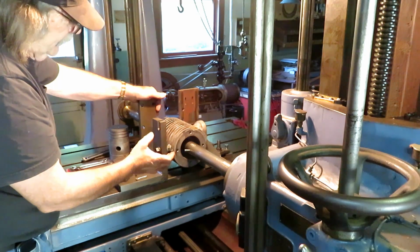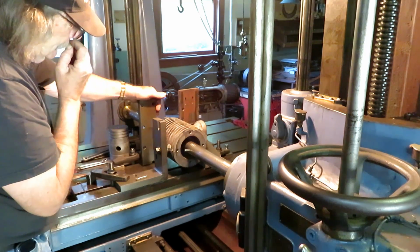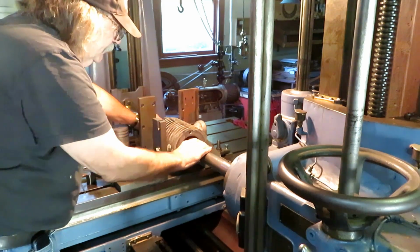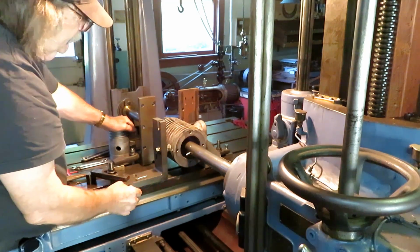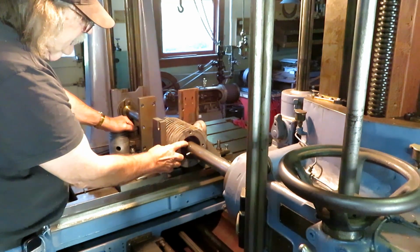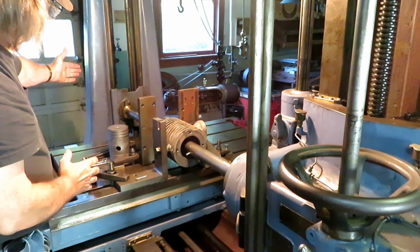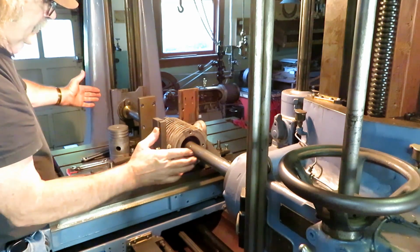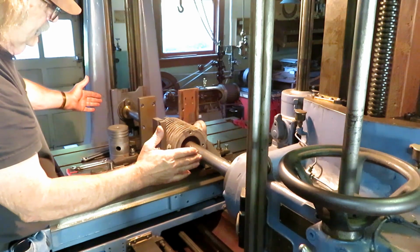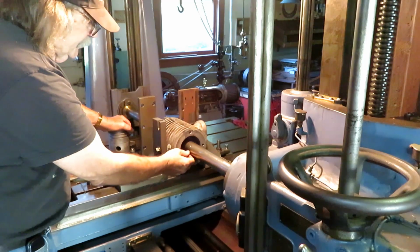And it's got to go a long ways anyway. I'm using an 1/8 inch thick sleeve, so we've got quite a ways to go. One thing I did do since the last boring mill job that you saw is I added another station here for a tool. It's about 8 inches closer to the end, so I can run the tailstock up tighter and reduce the amount of distance between the headstock and the tailstock, which should be a good thing.